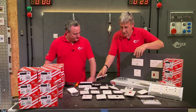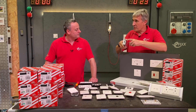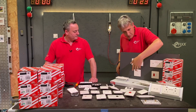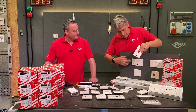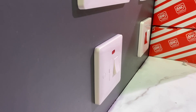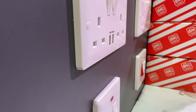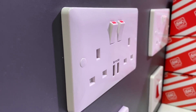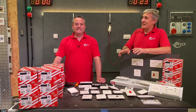Talking about how far the faceplates stick out - the socket fits comfortably in a 25mm back box. When you use it with other items from the range, a few spurs all the way up to your 45-amp double pole switch, that projection is constant across the range. That's usually noticeable in the kitchen when you look at electrical accessories and they're all flush to exactly the same place.